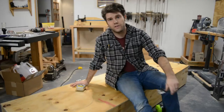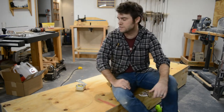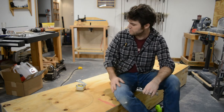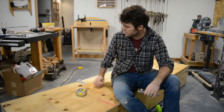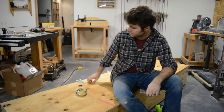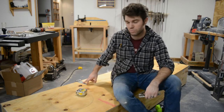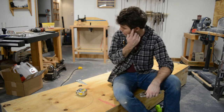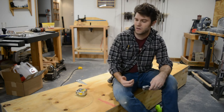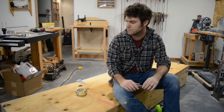Well, there you have it — that's the build. There are a couple things I want to change if I ever do these again, and I'll change them in the directions. One is that because this is only half-inch lumber, many of the screws don't really fit, so I'd trade them up to bolts and just bolt everything in. Two, this is only made out of half-inch plywood. The half-inch plywood tends to warp, especially if it's on the cheaper side — and this was on the cheaper side.